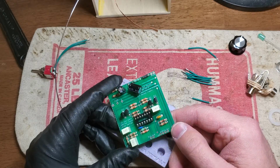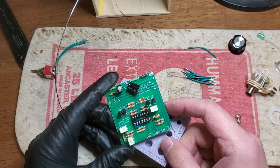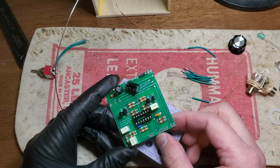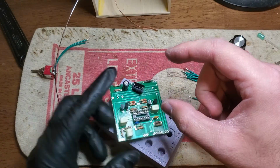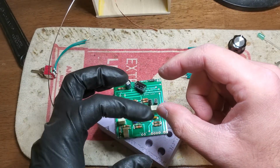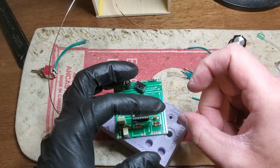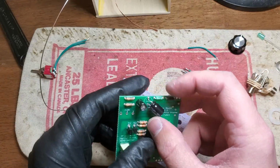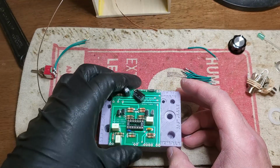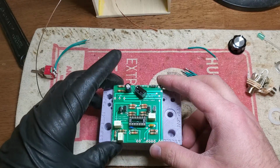So now instead of being a gain boost, this iteration of the expression circuit is a DC offset, which is admittedly a much more subtle effect. It becomes a bit more of a shifting texture. And it kind of forces the fold points. Yeah, see that's my little fold point indication. To be more focused on the negative swing of the waveform and leaving the positive swing mostly unmodified. Which does also give you the benefit of more interval clarity and low-end poking through. Because that clean amplitude isn't being subtractively chopped off in such a way.